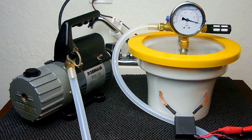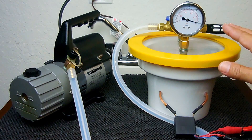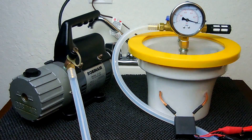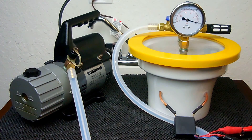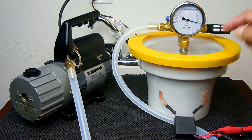Right here is a balloon filled with argon gas. I'm going to draw a vacuum on this chamber. Once that's complete, I'm going to take the balloon, place it over here, open the valve slowly, and draw only argon into the chamber. Once that's done, the next step is to turn on my power supply unit and then push down on this button, which is going to turn on the high voltage arc within the chamber.